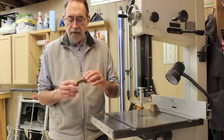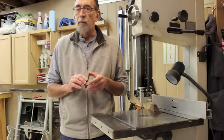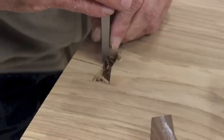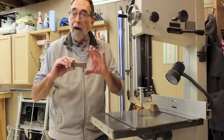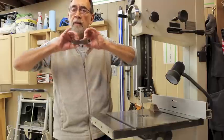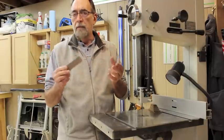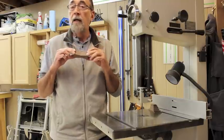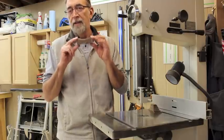Cutting these out is really quite easy. This happened to be some scrap walnut and I simply cut them out on the bandsaw. A couple of things to remember: first, you want nice straight edges — that makes it easier to get your chisel in and cut mortises to fit. Second, you don't want to make the ends too wide because they can get weak at the corner and break off. But you don't want them too skinny either, because you want the mechanical holding power to keep the crack together. You want a happy medium — not a Pee Wee Herman skinny bow tie or a great big clown bow tie, but something in the middle, like a Bing Crosby or Fred Astaire bow tie.